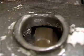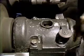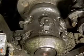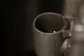There's an inspection opening at the top of the housing used to observe the movement of the ring — the ring should turn smoothly. If it isn't turning at all, the bearing won't be lubricated. The opening is also used for adding oil to the reservoir. The oil level is checked through a flip cup on the side; the oil level in this unit should be halfway up the cup.